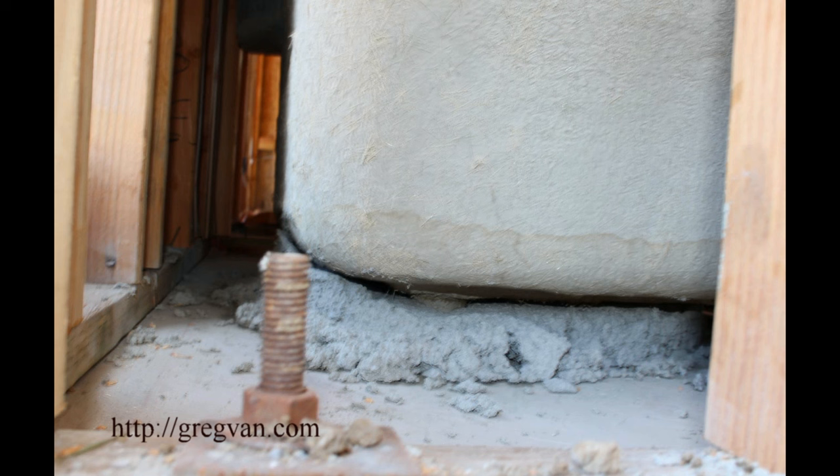Don't move the tub, and there is another solution: you could use plaster of Paris. A lot of old-time plumbers used nothing but plaster of Paris and it worked great — I've even used it myself. The only problem is you don't have a lot of time to work with it. I mixed it up once and set an acrylic shower pan. It dried a little faster than expected, and when I needed to pull the pan out, the plaster of Paris wouldn't let the bottom part go. It ended up cracking the pan and I had to go buy another one.